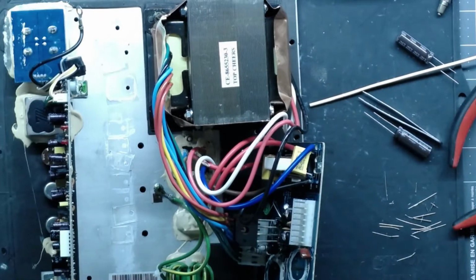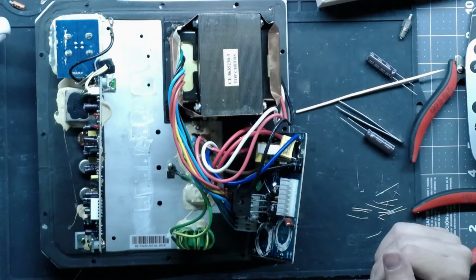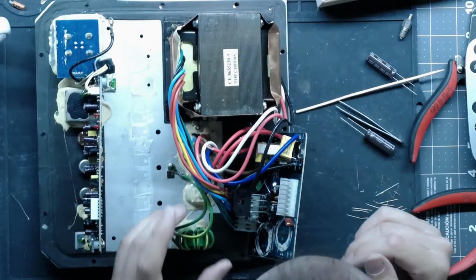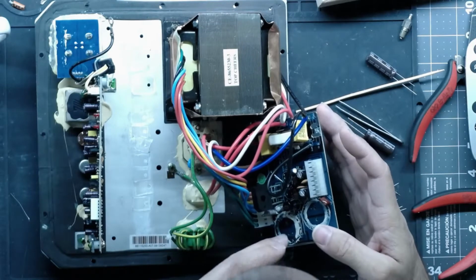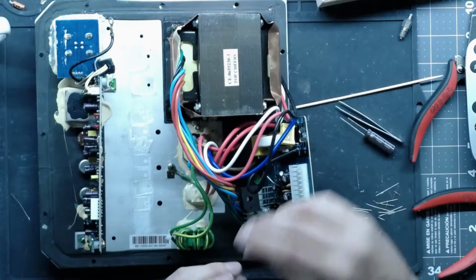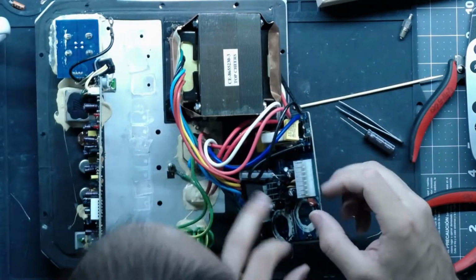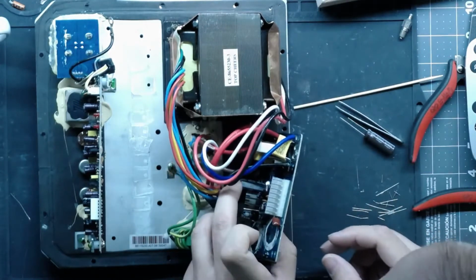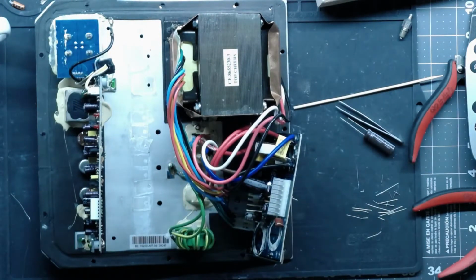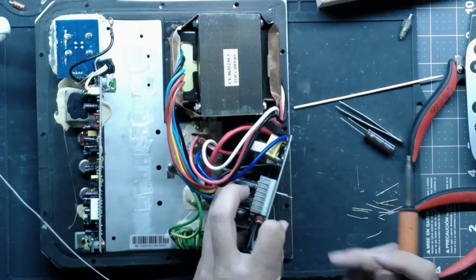Well, luckily that really won't hurt the performance of the amp, but it might allow some noise to get back into your electrical system. I don't know. It's a standard or a requirement that these companies do. Whether or not it helps or hurts anything on something like this, probably not, but everybody has to meet the compliance standards, so almost every piece of equipment you have is going to have some kind of filtering on there to prevent noise from getting back into the power lines. So we will fix that, and we will fix that wire that makes me unhappy.